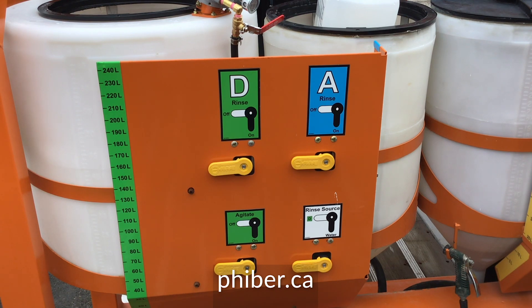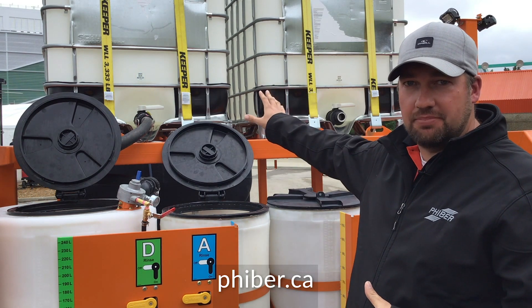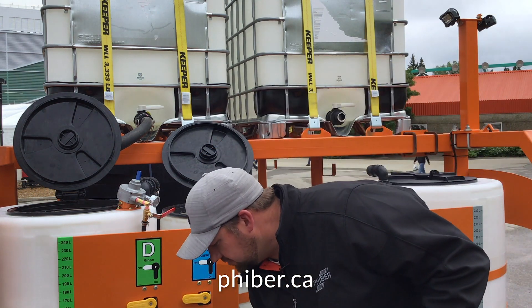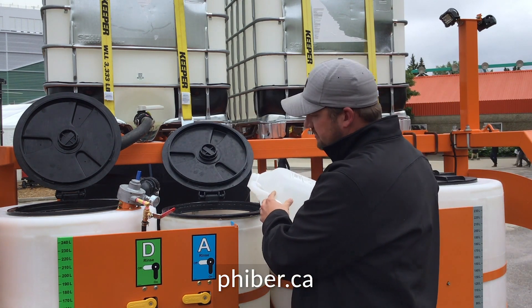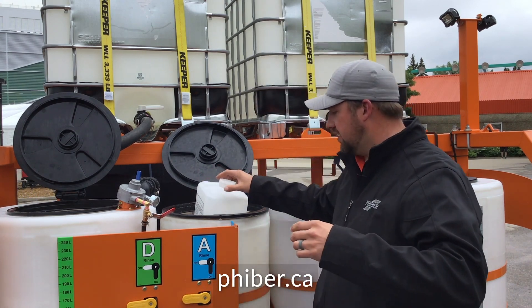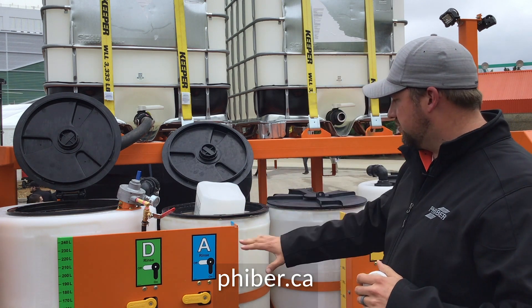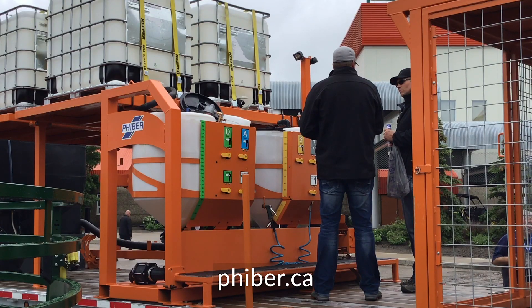To load this thing, there are a couple of different ways. We try to use gravity as much as possible with bulk products. You can see we have a whole tote platform system to store your chemicals just above so that you can use gravity to fill into your inductors to pre-measured amounts. We also have ways of handling jugs. All our inductors have rinsers in them — you just take the lids off, put them on the rinsers, wash the jugs out with quite an aggressive wash. We use the smaller inductors for jugs and the bigger ones for bulk products.